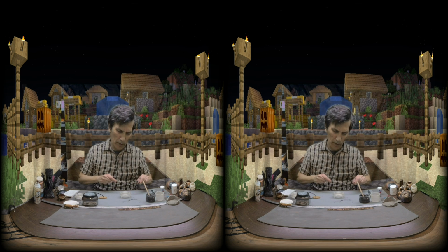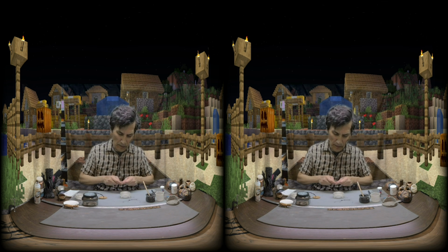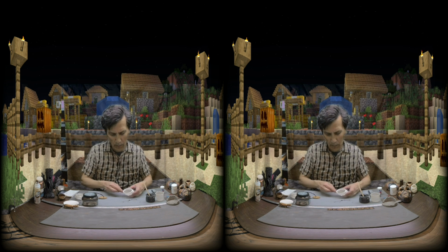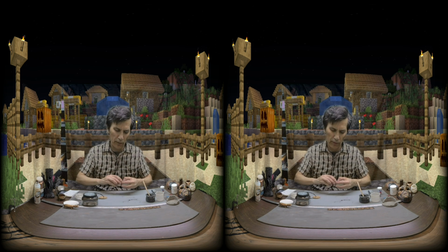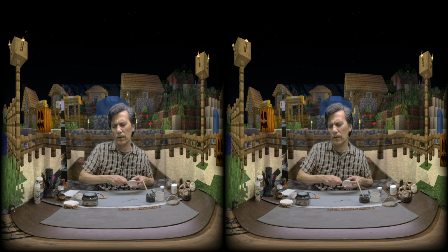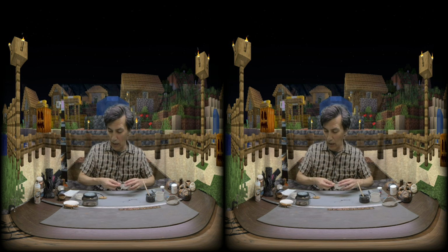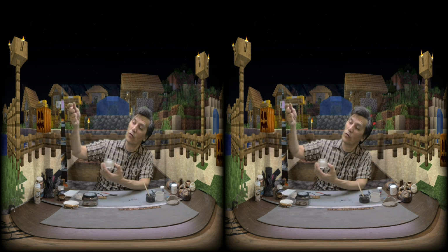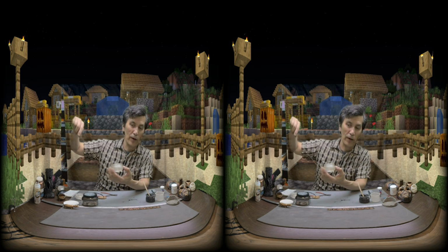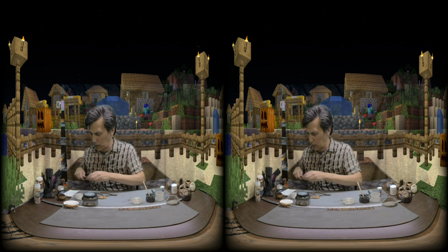So what I do is I incorporate my hanging wire, the wire that I suspend the part with, and the cathode wire, which I hook my negative to, here. So basically we just wrap some wire around, we give it a nice little wrap, because we can work with the aesthetic. So your wiring either has to work with your aesthetic or be hidden. So we just simply wrap this wire, which I actually took from an extension cord and stripped and pulled off strands to make this tiny little strand. Wrapped it around here. I tied a knot. There you go. There's one.